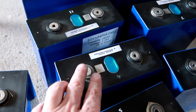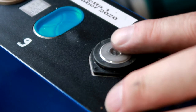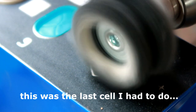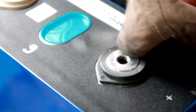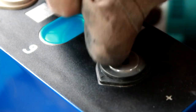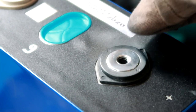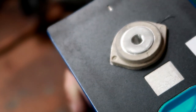I took bus bars off and on all the time to do some testing, and you can see all the marks later on — it's very hard to get them out, if at all. You can feel it's a very rough surface from the sanding. At the end I'm using a little bit of car polish to get all the remains of the compound and toothpaste off — this makes the last final treatment of the terminal. This is now nice and shiny while the other one is still matte and rough — there's no shine in there.